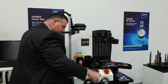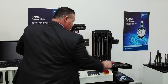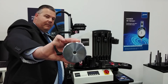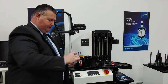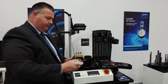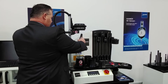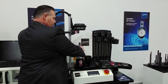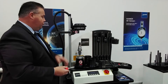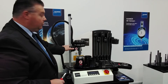First I'll remove this chuck support — you can see how the rod goes in from the back of the chuck support, sticks out, and you basically tighten the rod in there by tightening this screw. I'll support my holder. Basically the rod is sitting on the bottom of the broken cutting tool, so now all I have to do is heat up that holder and it will push the cutting tool out.